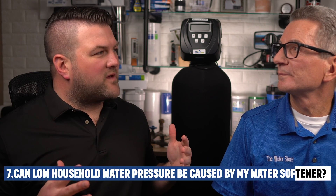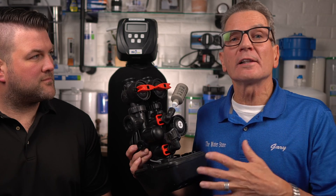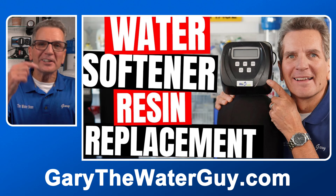Is it possible that my water softener could cause low water pressure throughout my house? Yes, it can — especially if you're on a chlorinated city or municipal water supply. The chlorine breaks down the media beads, which then clog the tank. Excess sand in your water softener can do it too. You can test it by temporarily bypassing your water softener, running water for a few days as normal, and if the flow improves when bypassed, that tells you the water softener is causing the clog. You'll need to replace the media to get it working properly again — there's a video showing exactly how, with a link in the description.